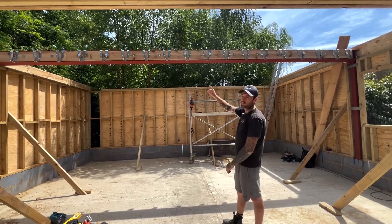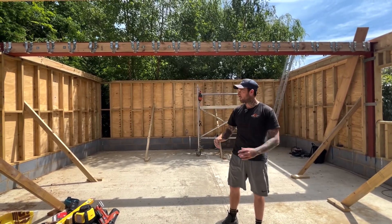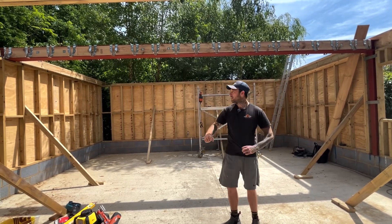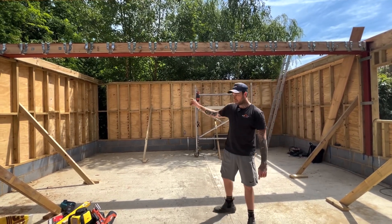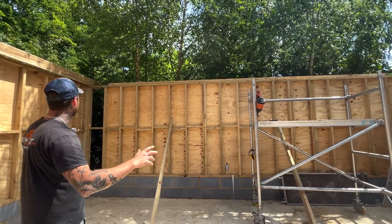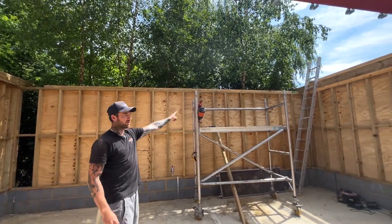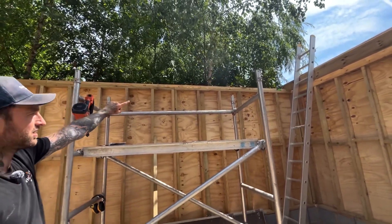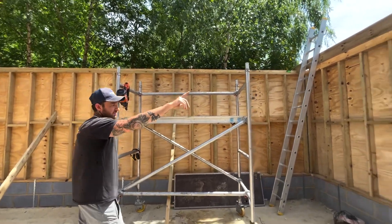As you can see we've got all the hangers on now. I've only filmed one side because it's much of the same thing both sides. We haven't filled all the holes yet as we're limited on nails, so I've put three per side just to get them all on. We laid the first joist in at each end, pulled a string line underneath on the hangers, then moved all the hangers down to the string line to get them all bang in line. At the back we've got one joist in at each end, and they actually landed directly on the plates, which is good. Some joists can sit straight on the wall, and five of them just need to be notched about three mil where the wall sits very slightly higher, so they're all perfectly level and flat.